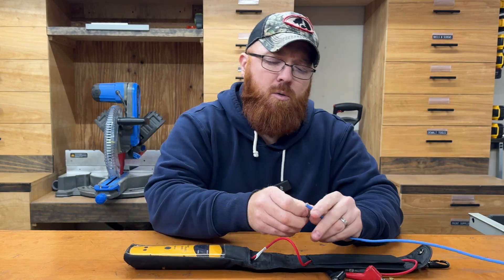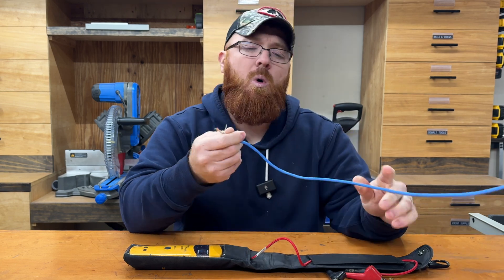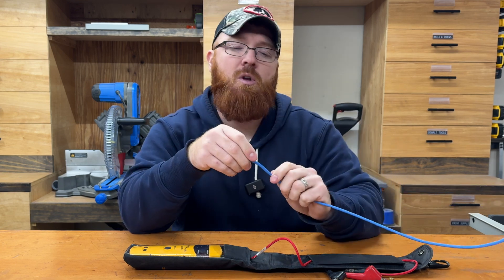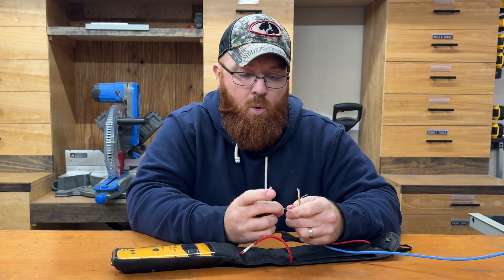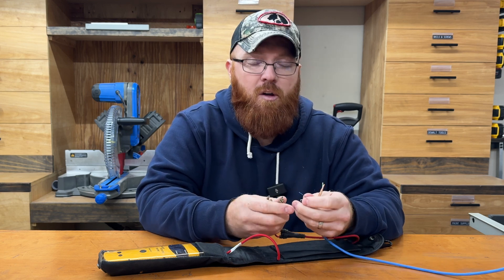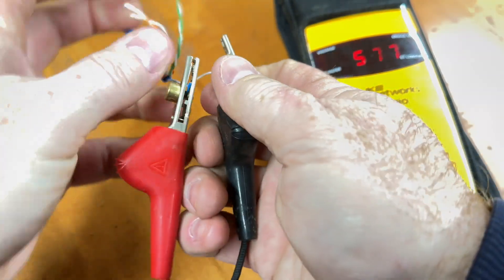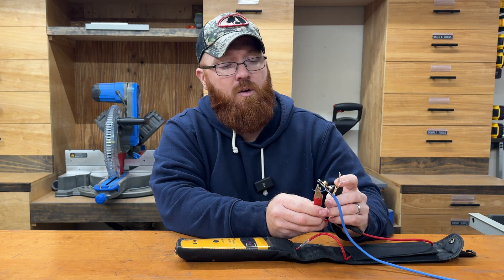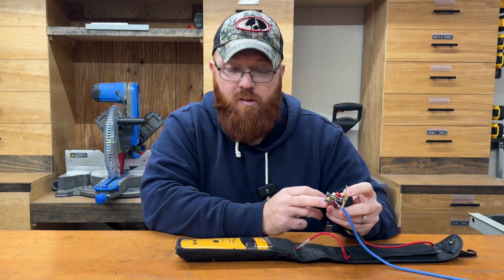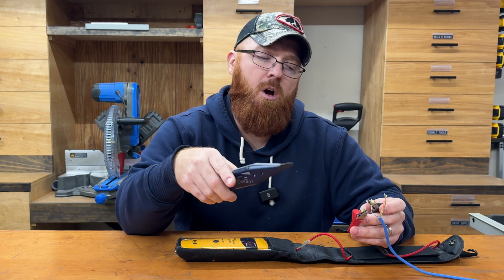When it comes to measuring footage, I'll show you what that looks like real quick. I've got a box of cat5 here. This is really good for measuring a real cable or a box cable to see what's left on it. I know the label on this shows the footage and you can just subtract the two numbers to see what's left, but if you couldn't read the markings anymore, this is the way to go. You just click onto your cable pair — this only reads on two-conductor wire, so you need two conductors. It'll read your short or your open, whichever is closest. Once you get hooked up, you turn the meter on and it's showing me 574 feet on this box of cable. And then if I was to short these two leads together, you get that tone — that's letting you know you've got a short on your line and it'll give you the distance to your short. It also gives you smart tone. You've got your little tone probe here — turn that on and you can hear the sound. That's going to let you ID a pair if you're down somewhere on the other end. You can leave this where it's at, go down to the other end, and find your cable pair. If you short that out, it changes all those tones.